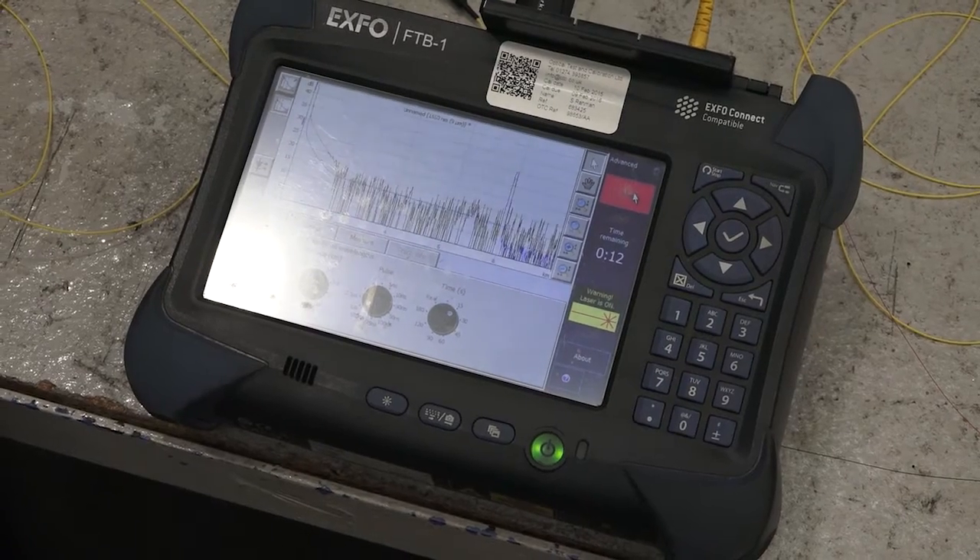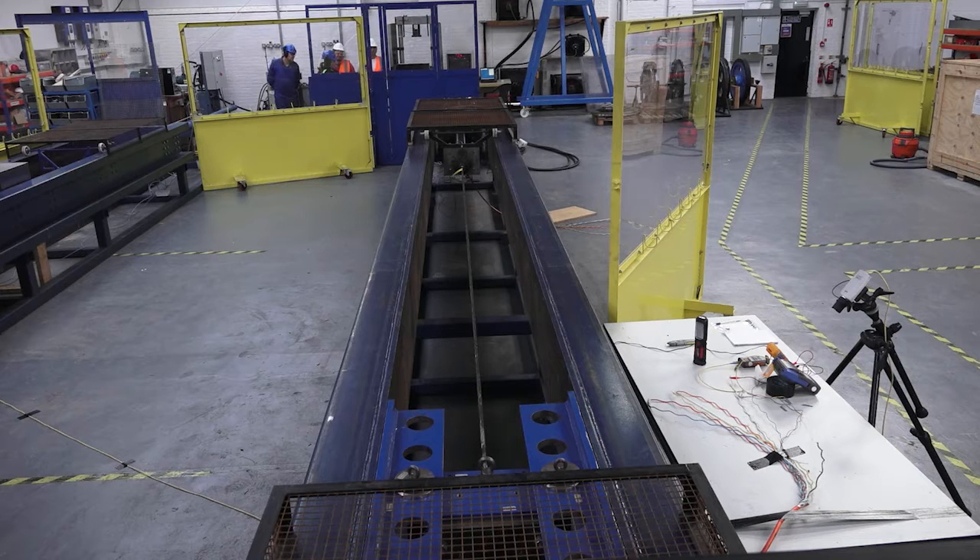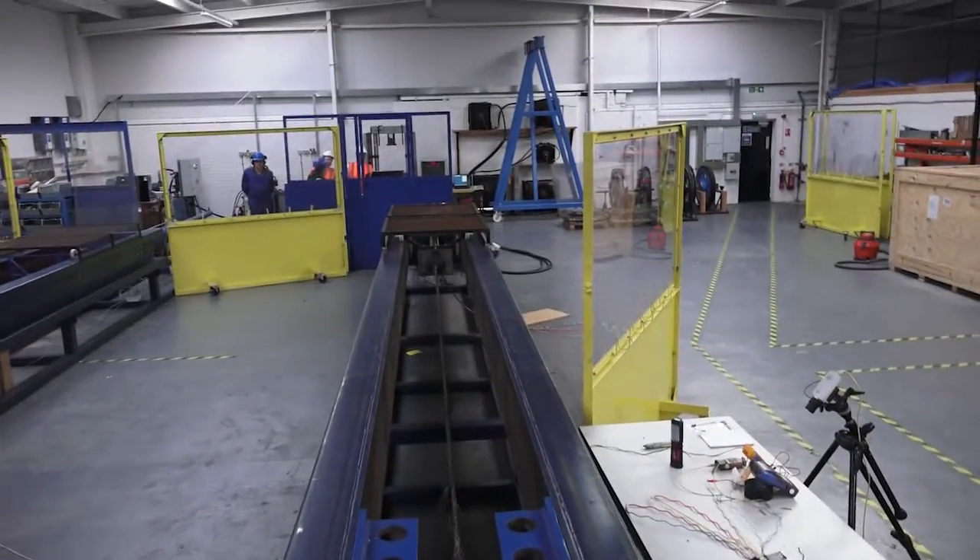The cable passed as we anticipated. The final step of the testing is testing the breaking strength of the cable. We cut a small segment of the cable run which is representative of the entire cable, and that's taken to a third-party facility where each of the ends are terminated and loaded into a machine that can stretch it out. It starts pulling on the cable and there's a load cell in series with the cable measuring the force we're applying. We know exactly how much force is put on the cable when it fails. We actually take this test section to destruction — there's a huge bang and the ground shakes and all of the tension in the cable is instantaneously relieved. We measure at what force that happened. In this case, the cable failed significantly beyond the specification.